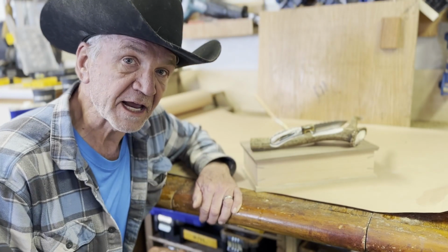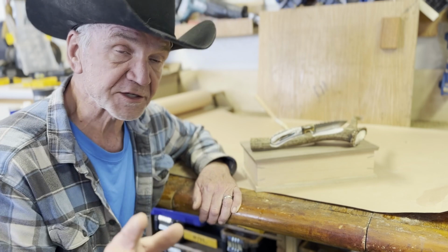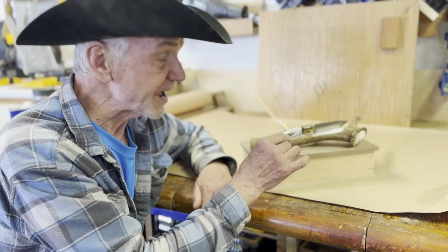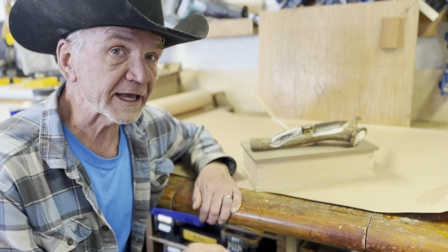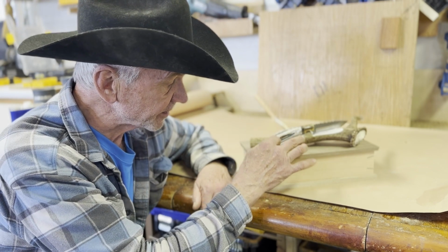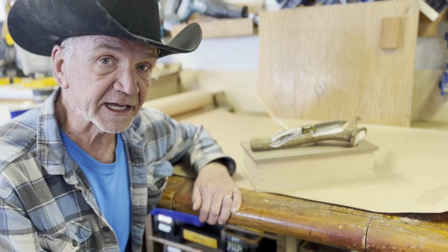All right, so I'm going to have to fix a kind of a bonehead error I made. It doesn't fit perfectly, I showed you that. What I should have done is brought the knife down from the house as I was doing the milling and checked the fit before I unclamped it from the Shaper Origin. That way I could have just adjusted the depth of the cut there, added a little negative offset to cut a little bit more out of that end.